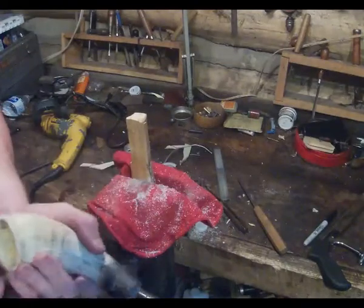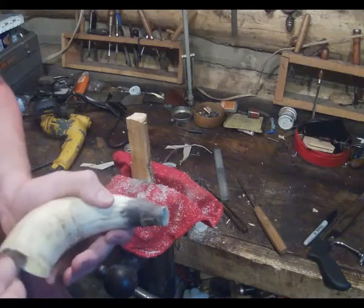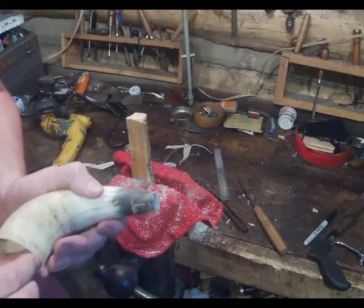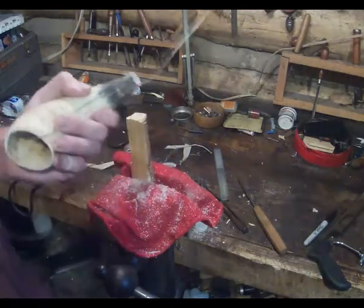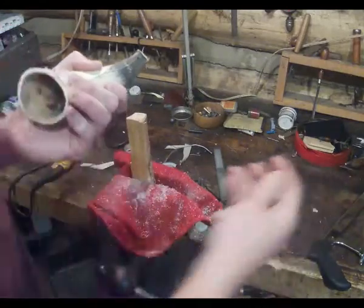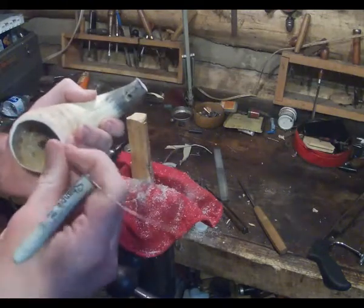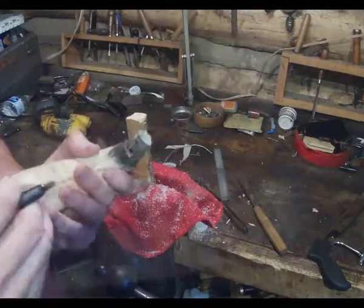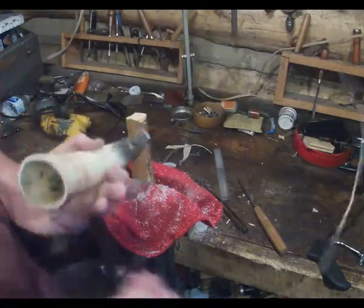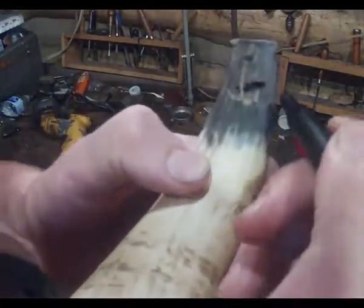Again, I'm going to check where the horn is saying that it should be solid. Looks like I might have got a bad reading — saying I've got about an inch to go. So I'm going to mark that, so I know if the drill bit gets much longer than this, I have an issue.